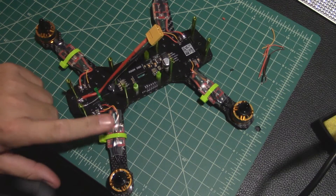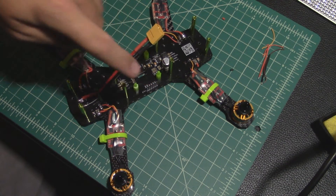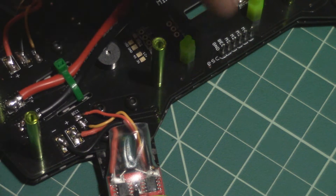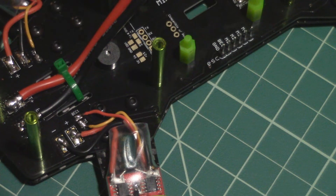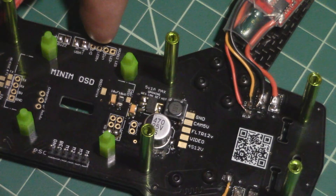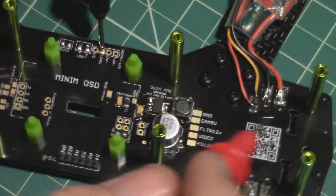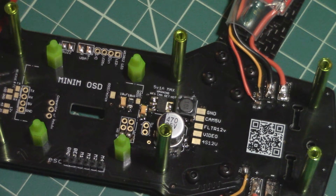As we look at the quad, motor 1 is back here. The BEC pad from motor 1 actually comes over here to the motor pin area on the nucleus board and feeds the BEC pin that's going to power the Naze32 directly. Then from motor 4, this BEC pad runs back over here to this side and provides 5 volts to run accessories like an LED array or something like that. So it shows where that one's going — LED 5 volt, there's my BEC pad right there.